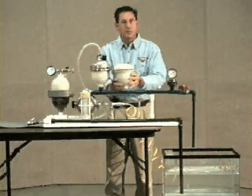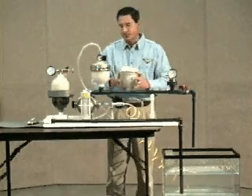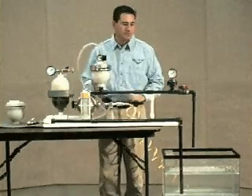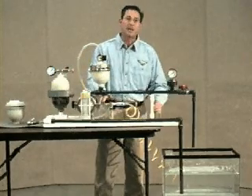Vertical is the preference, especially with a slurry or solid-laden product. For this test, I'm going to overcharge the dampener, which turns it off. When I turn the pump on, you'll see the pipe shaking, vibrating, and pulsating flow.